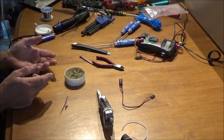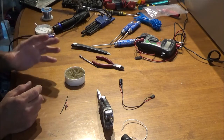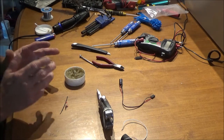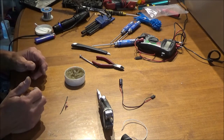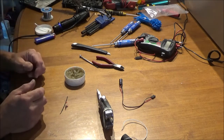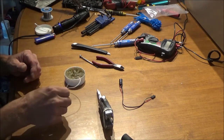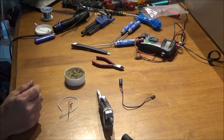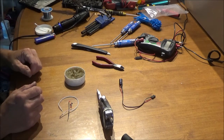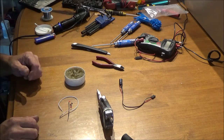As a side note, Great Hobbies looked up a 25 kilogram Savox servo and apparently it chews up 4 amps by itself. You absolutely cannot use that servo in any RC without a BEC, unless your built-in BEC has like 10 amps to feed the system. In dual servo situations at 4 amps each, you'd better have a really good BEC and that's going to cost you some bucks. I'm not a huge fan of Savox myself — I've had some experience with their servos and I think they're not great, and the owner of the rig that bought one on recommendation felt the same way. Thanks for watching, catch you on the next one.